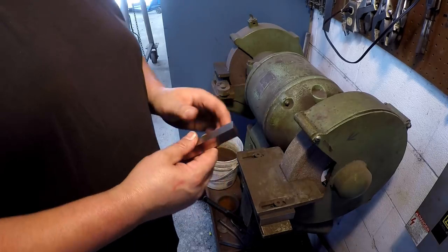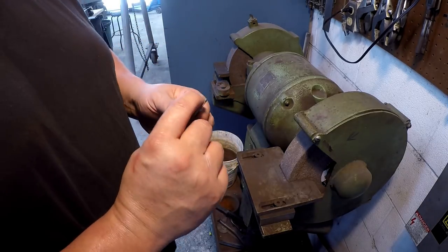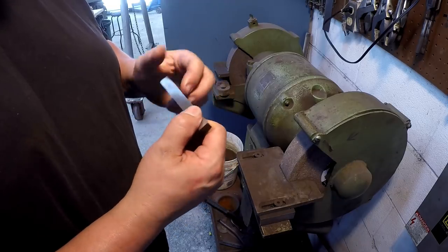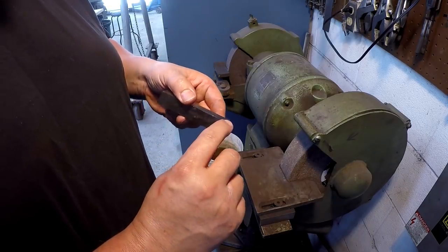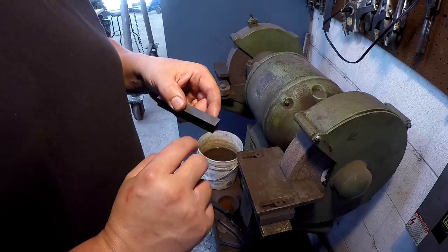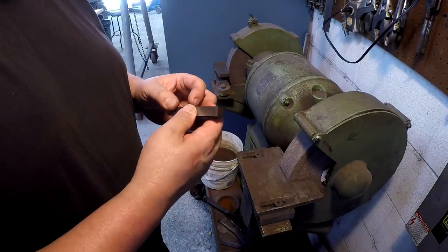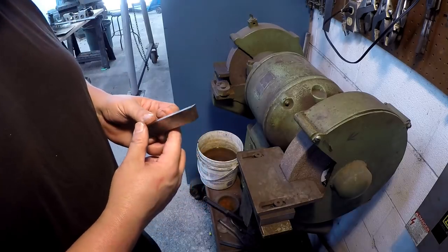It's gonna essentially be not a square nose tool, but it'll have a very slight radius on it, but it's going to have a very high helix angle. So we're going to grind an angle across the cutting edge right there. All right, I'll get the grind done and kind of give you a better shot of it so you can see what I'm talking about.